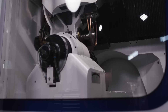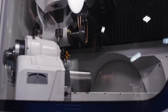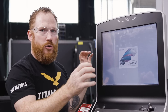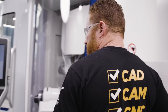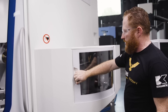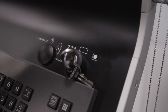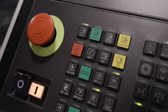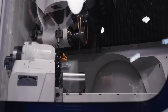Similar to most CNC machines, you have to home this machine in order to do anything on it. We're going to make sure that the doors are shut first, because this machine will not function properly unless all the doors are locked and shut — including this third door, which is our wheel changer. We have a selector switch here for robot, automatic, and manual, so we're going to turn the key to automatic mode. Make sure the machine is in auto, then we're going to hit ABS all move, and that's going to put the machine in its default home position.